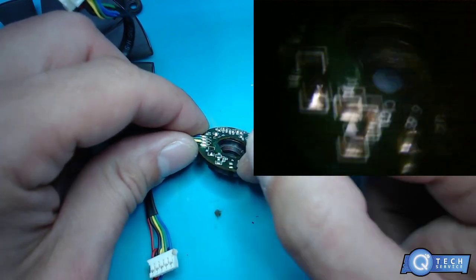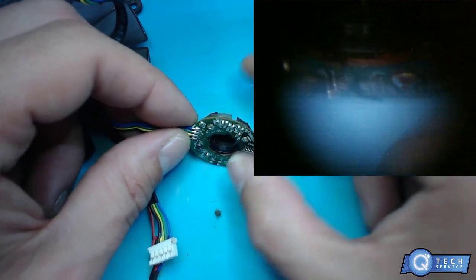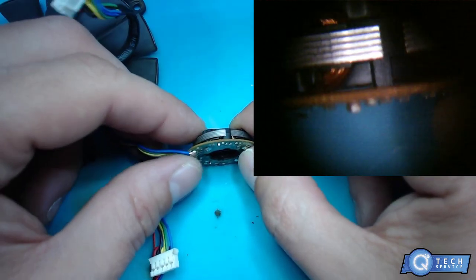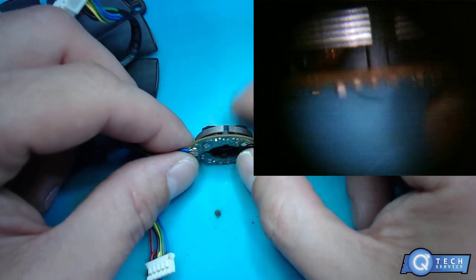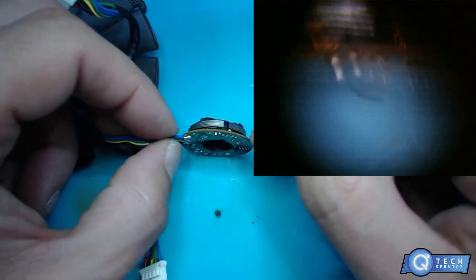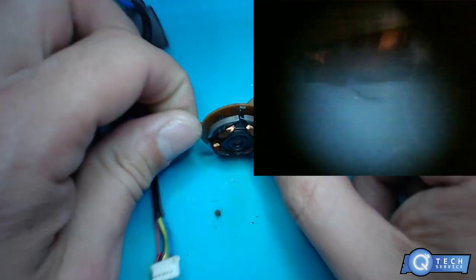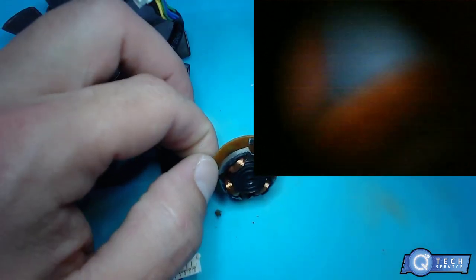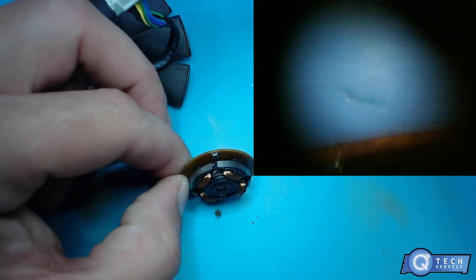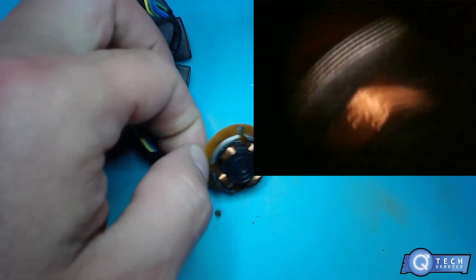If your fan is not working, so if you pushed on your fan and it's not working, and sometimes you got to press on it to have it start spinning, it's the solder joints between here and here. So we'd have to technically look and see which one has the coils sent to them. So this one would probably have the coil, but...